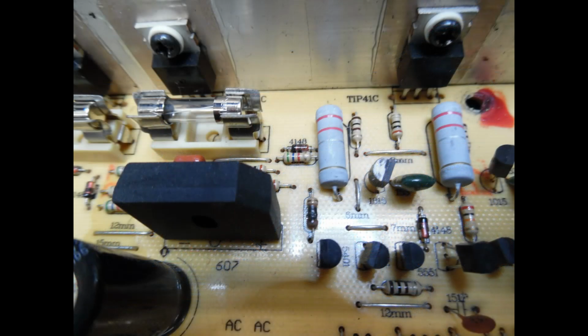Now, quite rightly, what the customer did was they went off and bought some replacement fuses of exactly the same rating, which is the correct thing to do. You never want to uprate them and then just replace the fuses, but on power up again the fuses failed. So of course that would indicate that there is a component failure on the amp.